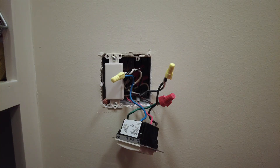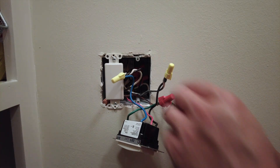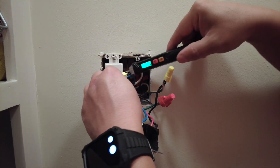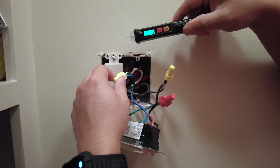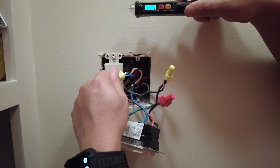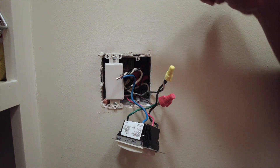Here you can see I'm pulling out each one of the cable colors up to where I can see the terminals and where the connections are being made. Once you've done this, examine the cable colors and understand which one is the hot, which one is the load, and which one is the source. I'm using a voltage tester here to confirm — I've already turned off the power from the circuit panel, but I'm using the voltage tester again. I'll put a link in the description where you can get one; they're really useful.